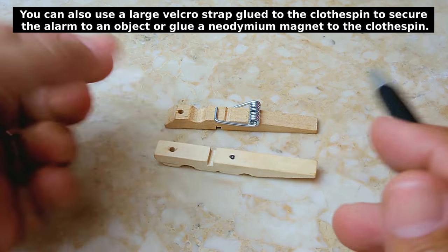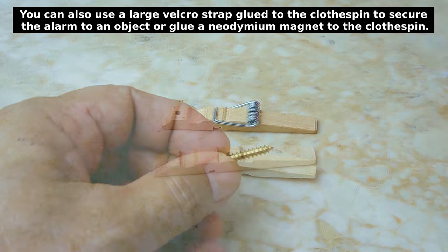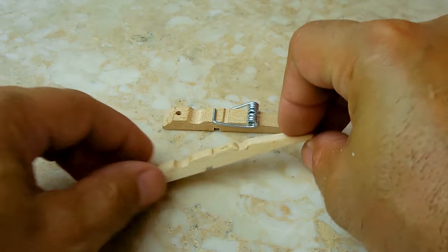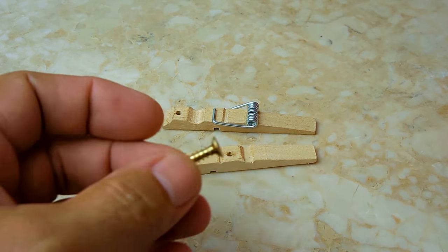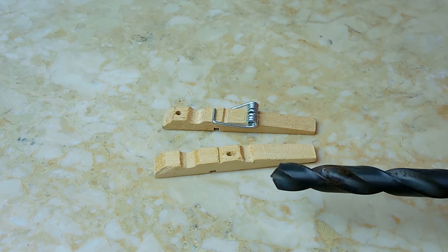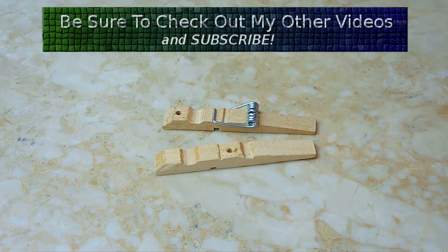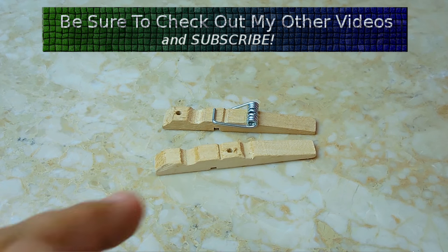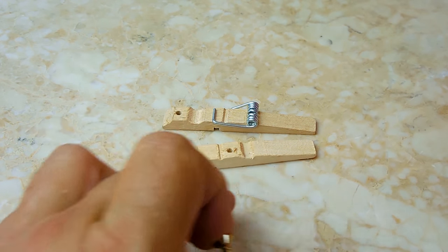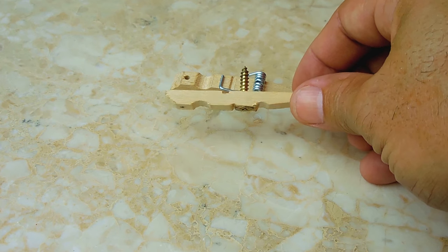You can drill a hole right there, and you're going to make it slightly smaller than the diameter of the sheet metal screw. Once the hole's been drilled, you're going to go on the inside. This is the part that was down like that. You're going to have to countersink that hole so this flathead goes nice and flush with the surface. You can use a 3/8 drill bit, a countersink bit, or a 1/2 inch bit. Just use this and spin it around a little bit. Once you get it to the right area where it's going to go flush, apply crazy glue inside this hole and on the threads and screw it in tight from the inside going out. This is what it looks like with the screw in place with the crazy glue. It's flush on the bottom.